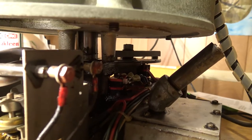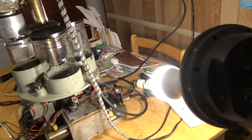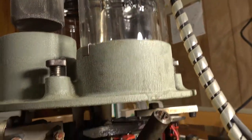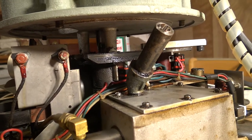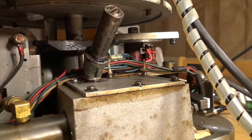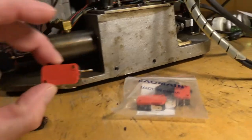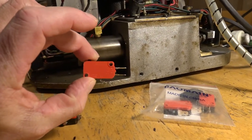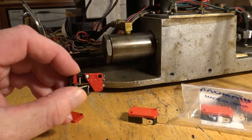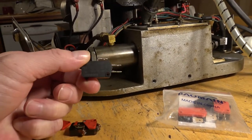I'm going to fire this thing up and show you how it works — it's fully mechanical, just so cool. The problem I had was that it would go into the cleaning cycle, wash the parts, and then stop. After doing some diagnostics I realized this top micro switch was bad. These old buggers are supposed to click — on, off, on, off — but look at this one: nothing. It's broken. Turns out they're selling them on Amazon, hot dog!